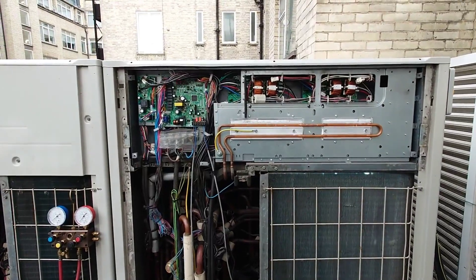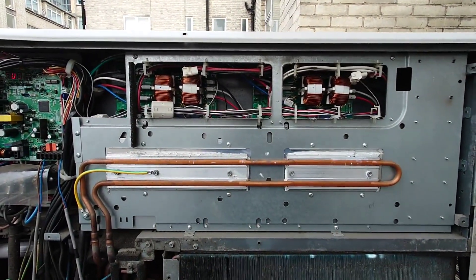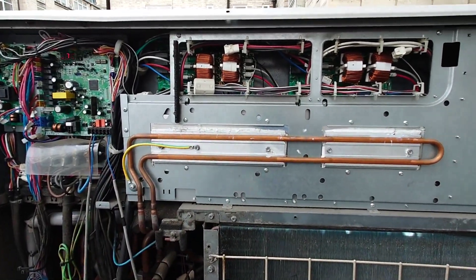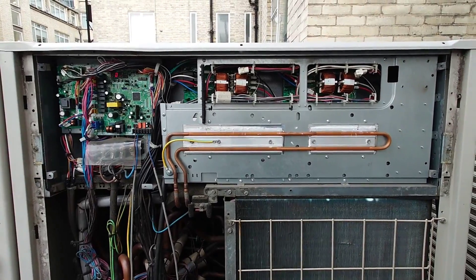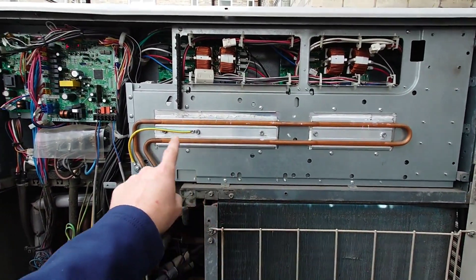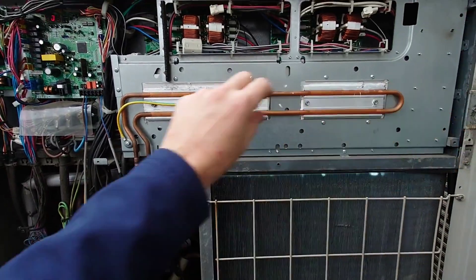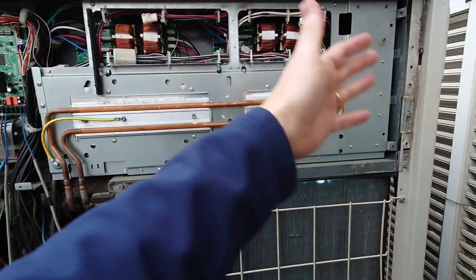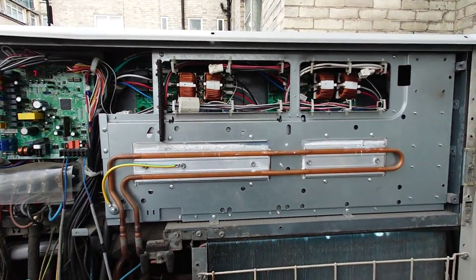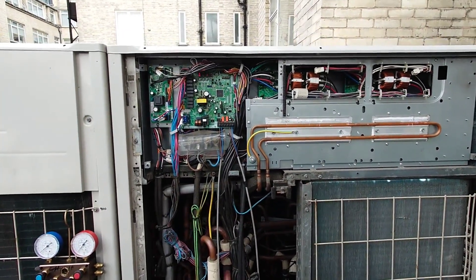That's your top panel off, which exposes all your circuit boards. You can see there are your two inverter boards. To get to those you've got to take this plate off, which is connected to a hot gas pipe that's there to keep heat within the control board area and stop condensation forming during the winter months. You may have seen this on previous videos — they literally come away and just fall down on this set of pipes here. It looks a bit tricky but it's not. Once you've got this plate out you've got full access to the two inverter boards. I'm going to assume it's the one on the right but we'll check that once we start pulling everything apart.